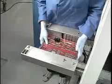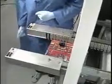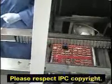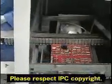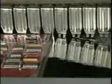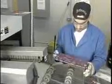These assemblies are now loaded onto the conveyor and run through the machine. It's critical that the assembly is loaded with correct component and lead orientation as determined by board layout. We follow the assemblies through fluxing, preheating, soldering, and cool down. Then we carefully inspect each assembly.